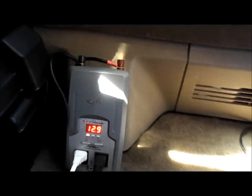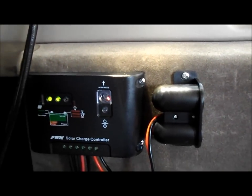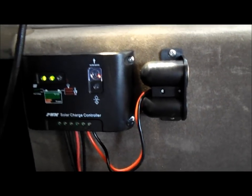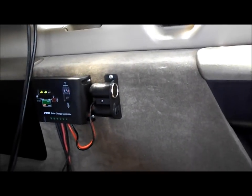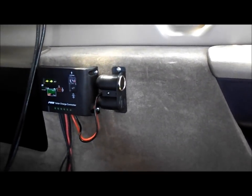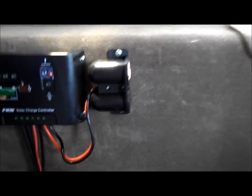This is the most important discovery for this PWM charge controller — I don't know how other charge controllers work, this is my only experience, but hopefully you guys can figure it out. These two wires are the solar panel going into the charge controller, these two wires are the battery going into the charge controller, and these two wires go into this cigarette lighter and USB connection. What this does is let me run directly off solar — I'm not borrowing any power from the battery at all.